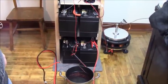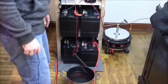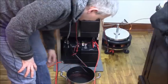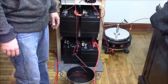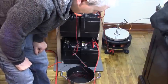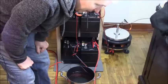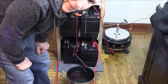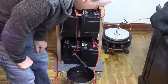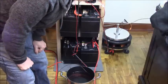So what I have here is a big coil, just to make a quick resistor. I have 100 feet of wire, which, at 12 volts input, with the 12 volt battery bank discharging, gives me about 60 amps. So what I did is I just discharged each battery cell to make them even, and then I finally discharged them again.